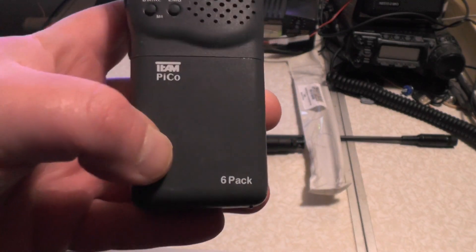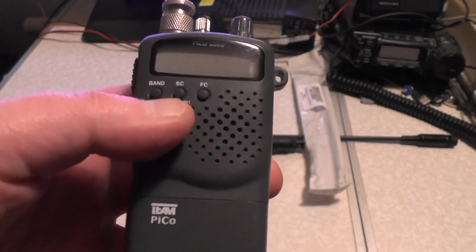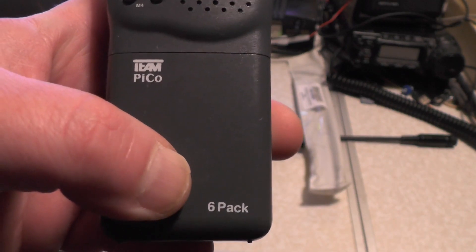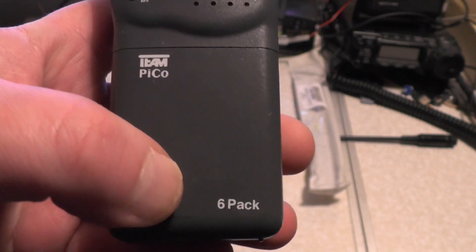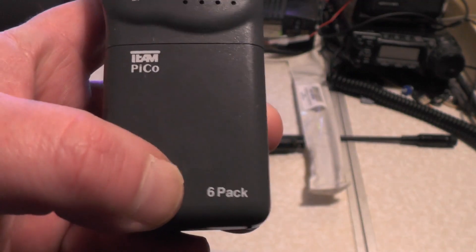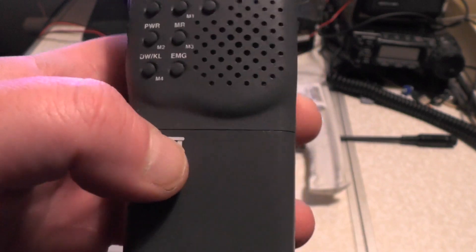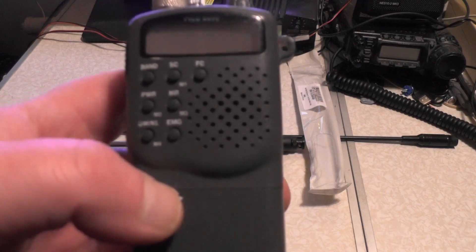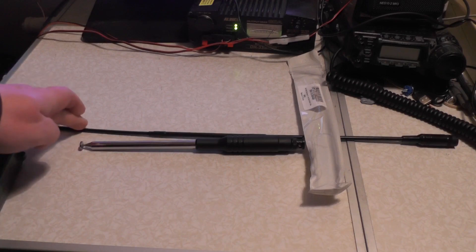I also want to know if anyone knows where to get the 8-pack battery cell from. This Team Pico only does a 6-pack, and the radio will only work on low power. If I power it up and use high power, the radio makes a chopping sound on the airways. I thought the PLL might need tightening, but according to what I've read online, I need the 8-pack battery pack to make it work on high power. Maybe I should just try it off a power supply. But yeah, I want to compare the differences between this antenna and the Albrecht at some point.